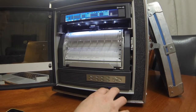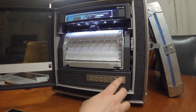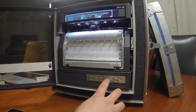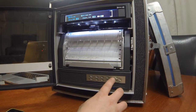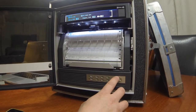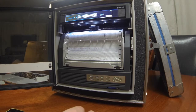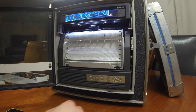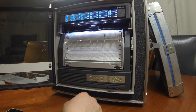Now, if we want to copy channel 1 again, we just hit function number 2. We go through and make sure we select all the options with a check mark next to each box. Our source channel, in this instance, will be channel number 1, and our destination channels will be 2 through 24. We hit Copy at the very bottom of the page so all that information gets copied over. Once it's complete copying, we can hit Escape, then Escape again, and we can go back and see that all 24 channels have been entered in this list.